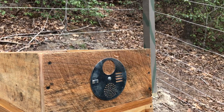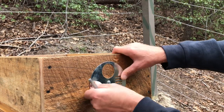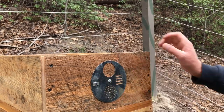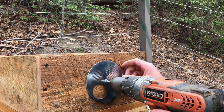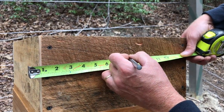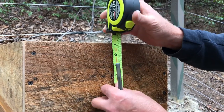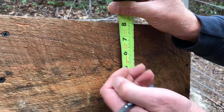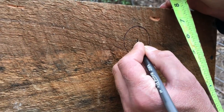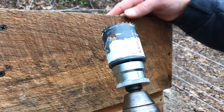Mark where you want your hole — whether you want it here, here, on the sides — it's your personal preference. I'm going to make it look as level as possible. Take your marking device, make a circle for the hole, then remove the assembly. The disc opening is an inch and three-quarters across, so the center point is going to be seven-eighths of an inch. Go seven-eighths this way, flip it around, and go seven-eighths the other way from the edge to find your center point for the pilot bit on the hole saw.